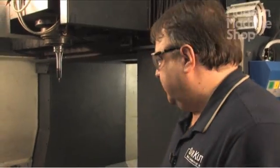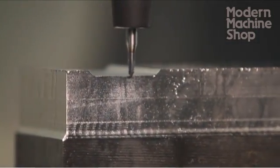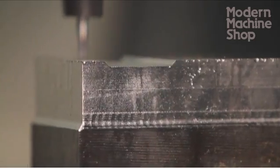If the chipping is occurring at the highest contact point of the cutter, then that's when you need to reduce your depth of cut. We've now cut two slots and we have over two hours of machining with this one tool. We're not seeing any significant wear. If we can take a bigger depth of cut, a bigger chip load, and still have the 200 inch a minute feed rate — the reason we're holding at 200 inches a minute is that in three dimensional geometry, getting over 200 inches a minute of constant feed is rare unless you're on large parts.